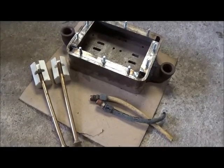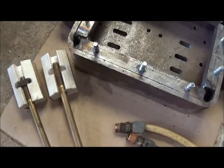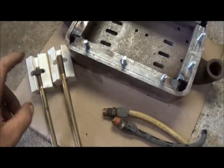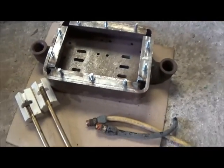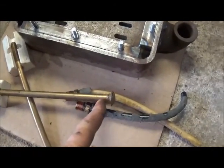Okay folks, we're back to work on the steam engine and here's our progress so far. Got both valves made — slide valves — and we can call these D-valves too because of the shape of them. They're both finished up. I've still got to find another 3/8 square nut; I don't know why I can't find one, I should have plenty around. Now what we've got to do is run these through the wall of the steam chest.